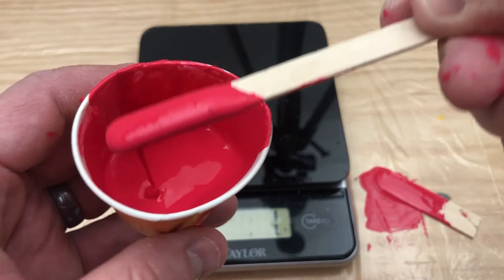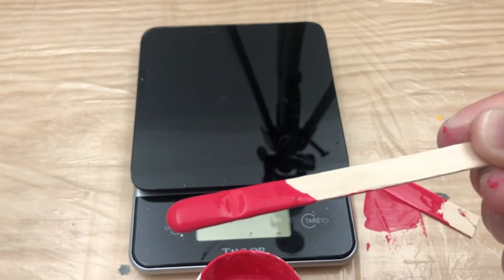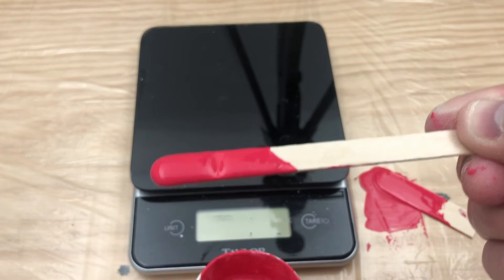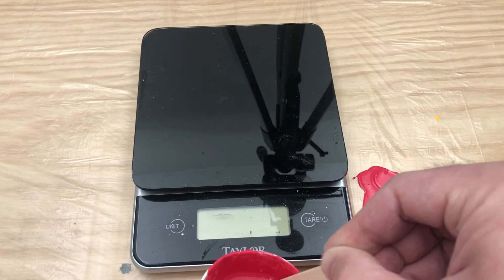The last gauge is a little bit different — I've seen a couple people measure this way. They take the paint and scrape their finger slowly through it and see how quickly the paint comes back to meet. If it meets in a couple of seconds, that means the paint is about the right consistency because it's flowing back on itself. If the paint was too thick, it would just stay like that. So that's the third way to test consistency.